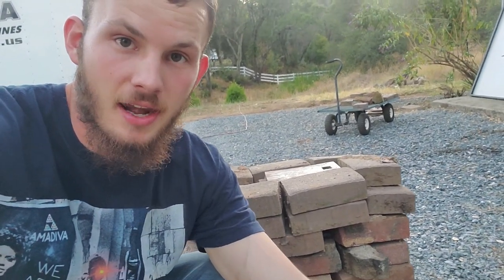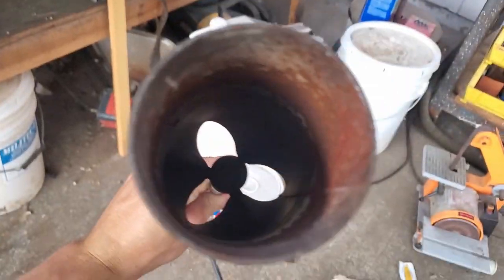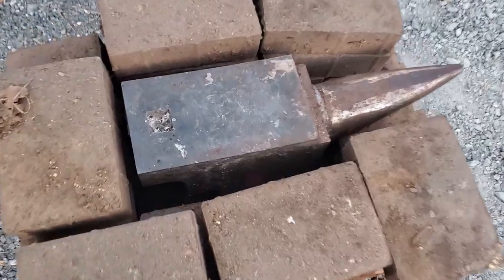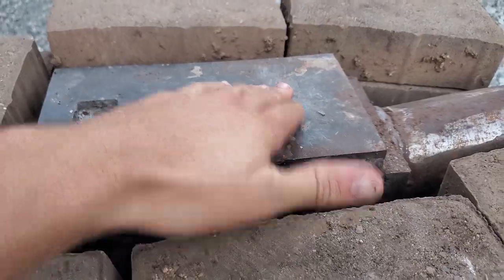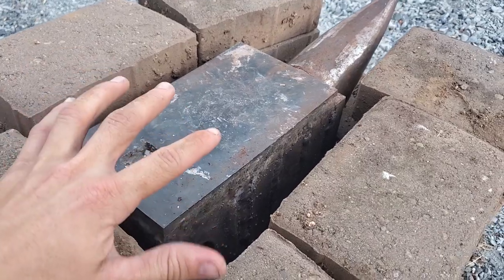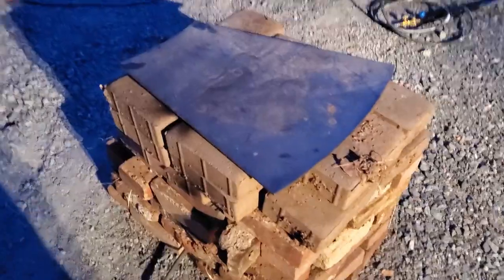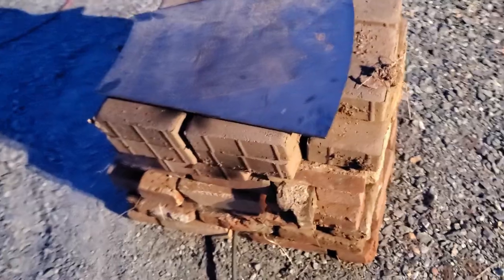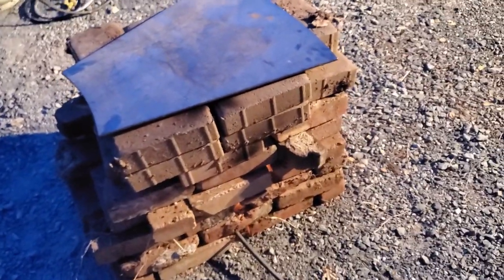She's been burning now for about 10 minutes. My dad's going to run to the store and fill up the other propane bottles so we can use the weed burners — two weed burners plus this bottom burner, three burners in total. We're going to try to get to about 1800 degrees; we'll see if we have enough heat to do so. We're now at the point where you can just barely put your hand on the top and it's quickly too hot, but it's going to take a long time for the heat to transfer throughout this entire steel block. We put this plate on top to keep in some of the heat — the steel sucks in that heat but it's better than an open top.